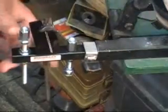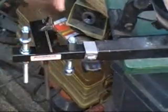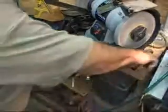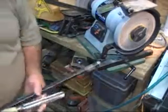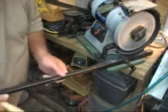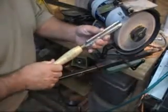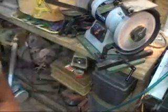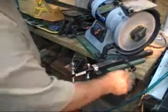The little feature that I have that other folks don't, I call it the Accu Set, because it's a good name. It's a bracket that mounts on it. Say, for instance, you're going to pull out your template and put in another one you made at home for sharpening, maybe a roughing gouge or a bowl gouge, which you don't do an elliptical on. So you shove it in, you get it all lined up, and you go ahead and grind your bowl gouge. And now you want to go back to your other grind. Do you have to do the math? No. I've got the Accu Set on there. You push it in, lock it down, you're back in business.